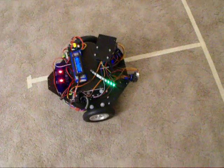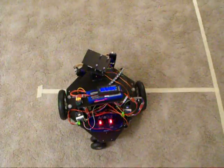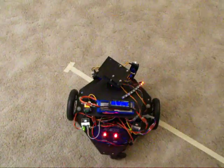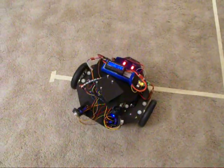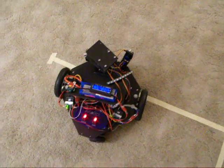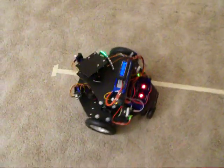I'm getting quite a bit of error on the encoders - it's off by about four or five encoder ticks. There's definitely more error going one direction than the other; when it spins to the left it tends to have more error. So what are we up to, about 30 I think is our speed now - as you can see we're getting more error.